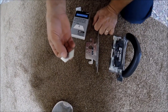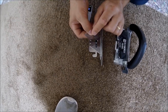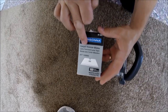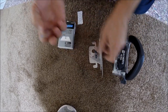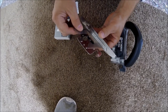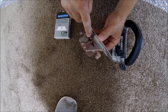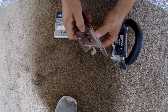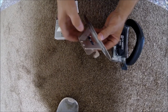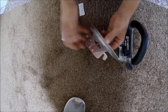These are not average utility blades. Utility blades have two slots in them where this only has one. These are made specifically for a carpet trimmer. You got a little groove right here — stick it right there — and then you got this little bump here and a little bump there is what your blade sits on. This is just a spring to hold it tight in there. This little bump right here will go in that groove and it just kind of snaps right in there.